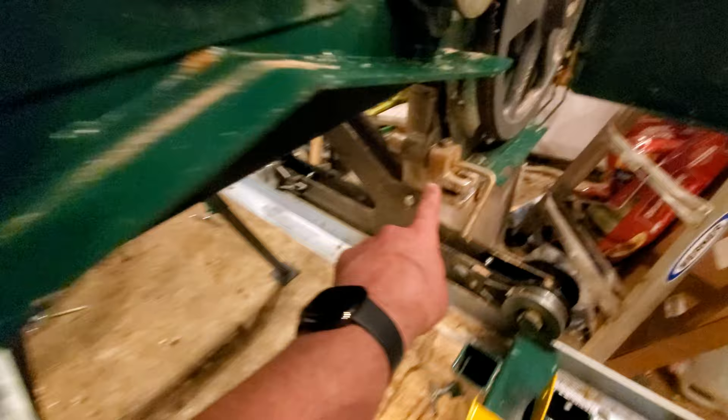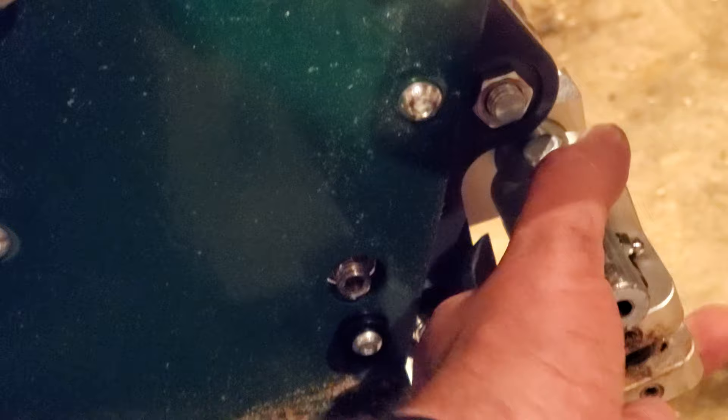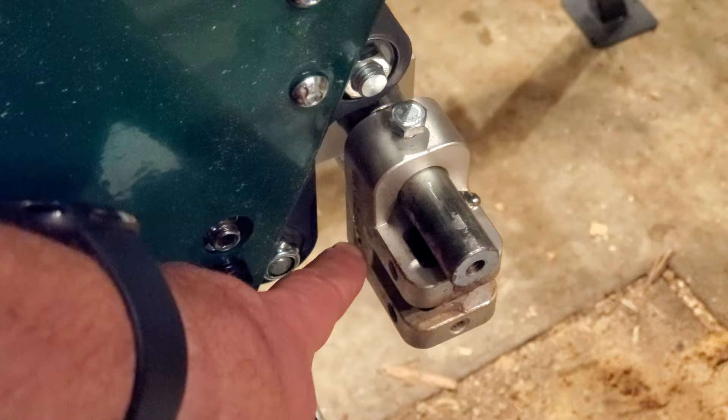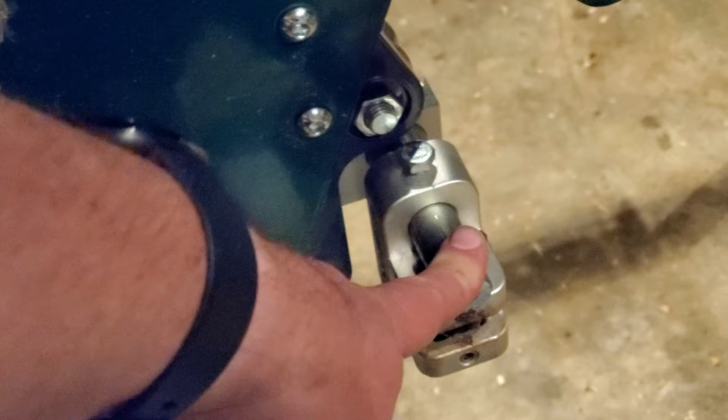If you look at where the set bolt is here, let's draw a straight line — I kind of cut that bolt in half. We want to be able to do the same thing here. You can see how I have it so it's too far back, but I have it so I can come forward just a little bit. So there's roughly where it needs to be. We need some adjustment so we can set the roller bearing for the back of the blade — we need to be able to adjust it forward and back. I can probably pull this piece forward maybe an eighth to a quarter inch and still be right, but we don't want to come so far forward that we hit this fitting.